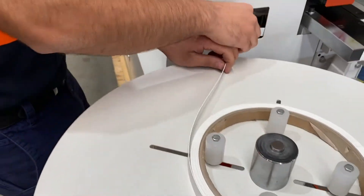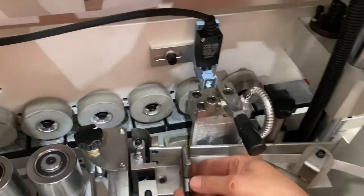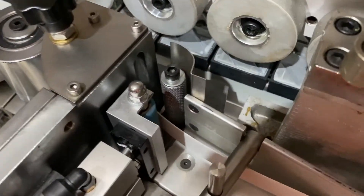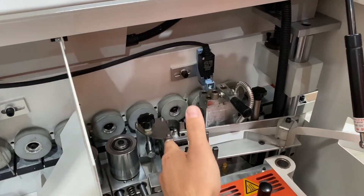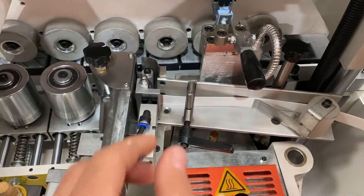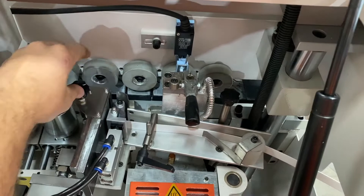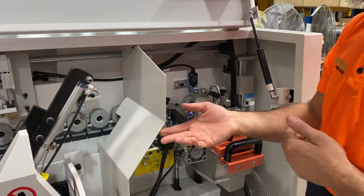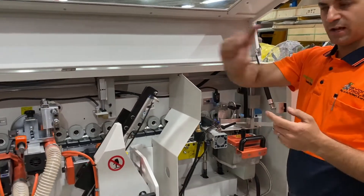To feed your edge tape, feed it through the little hole here and then through this little roller down here. You may need to lift this up and then it will go in between the two rollers. We want to start it at the guillotine here where it cuts — that's where we want the front of the edge. Then lower this edge strip guide down, lifting it about one millimetre, and the same with this one here. Screw it down till it's touching the tape and the tape's tight, then back it off about one turn so the tape moves through nice and smoothly. If it's too tight it won't feed through; if it's too loose the edging will ride up and won't feed onto the panel properly.